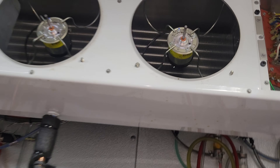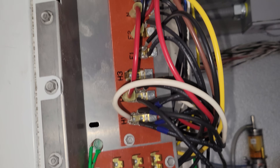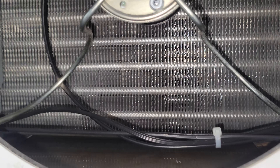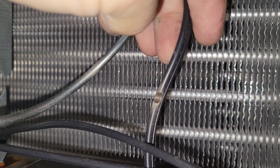Got the coil opened up, checked all the terminals to ground, didn't get any direct shorts. So we just have to start investigating and looking. A very common electrical short issue is where wires rub out — that is exposed wire. But you don't just stop at the first thing you see because sometimes they can be intermittent.